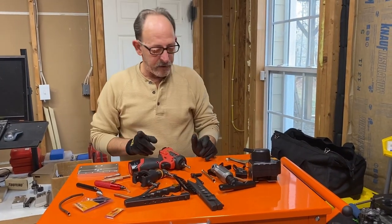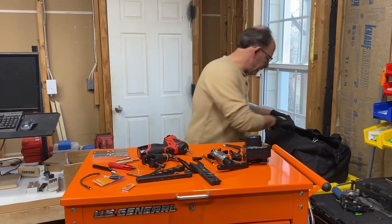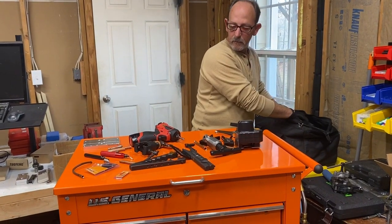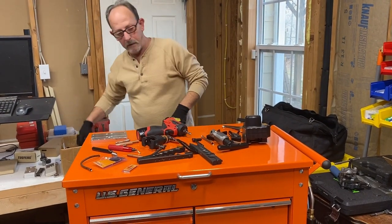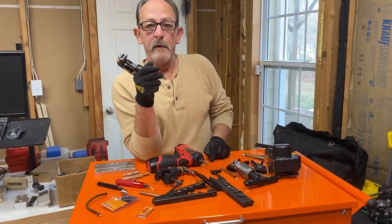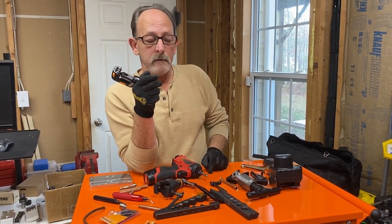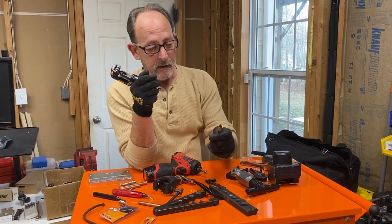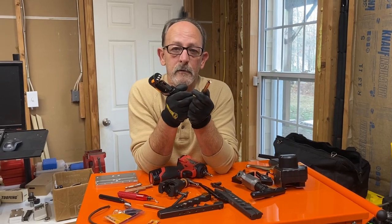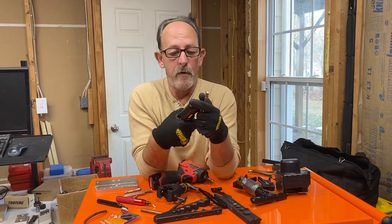One more thing I want to show you guys, when you're cutting your copper, because you know what? Where's my tubing cutter at? Ah, right here. I screwed up. You know how I screwed up? I screwed up because I forgot to put the flipping flare nut on this flare, right? I forgot to put the flare nut on it, so I'm gonna cut it off.